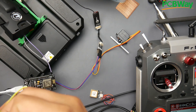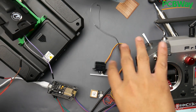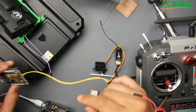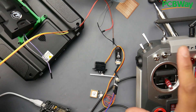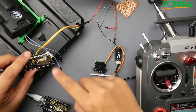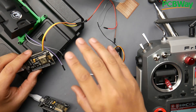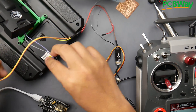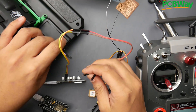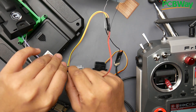This bottom one is connected to the FRSky transmitter. Now I need to get my second ESP and connect it to the TBS Crossfire module. The PPM signal flows from the FRSky transmitter down to the ESP8266, which is the master, and then it broadcasts it down to the second one, which is connected to the TBS Crossfire. So we're just piping the PPM signal wirelessly between these two — building a wireless bridge. Hopefully that makes sense, because this is really fun and interesting.